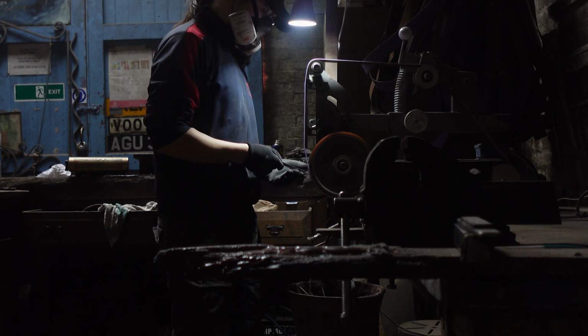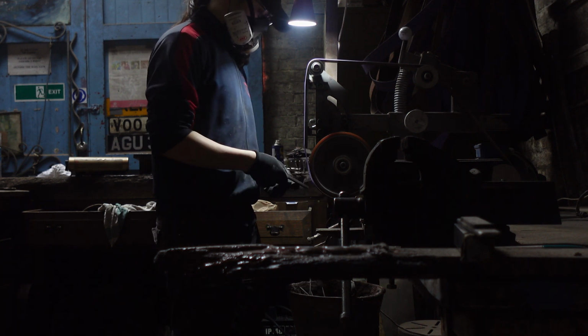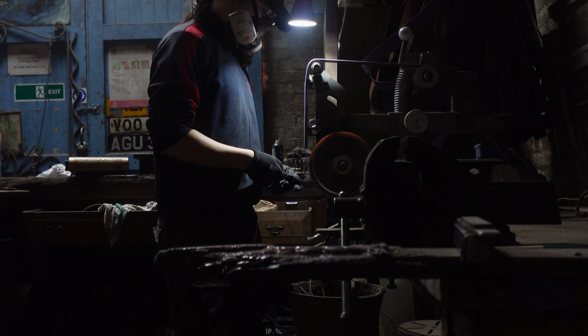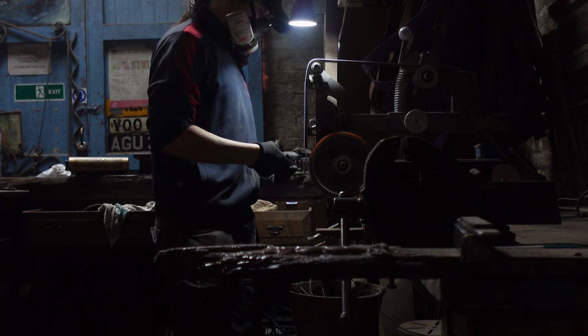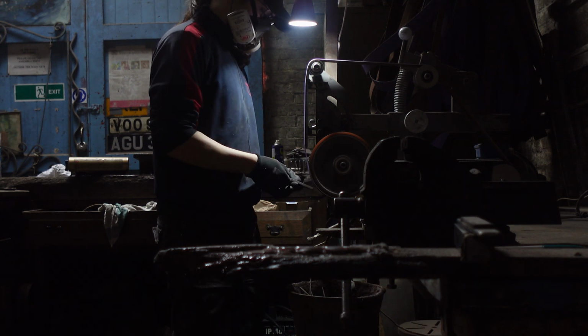If you do need to degrease your layers, degrease before grinding, as a degreaser leaves a film that can inhibit forge welding. I like to keep my ferrous layers slightly wider. This is so the seam welds don't get contaminated with non-ferrous material.